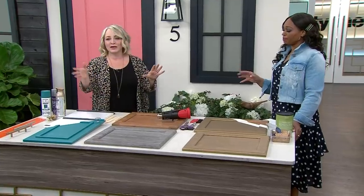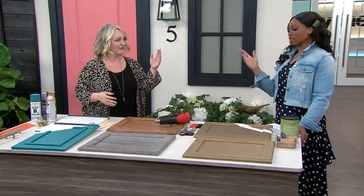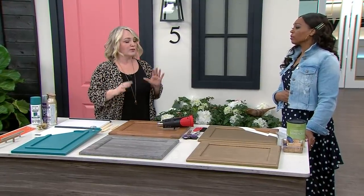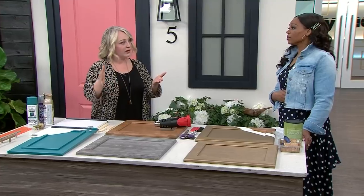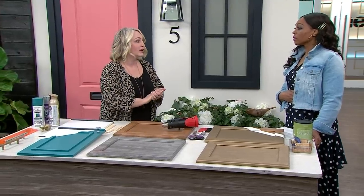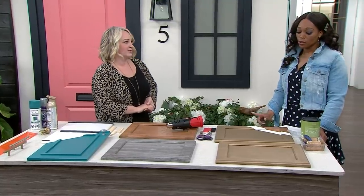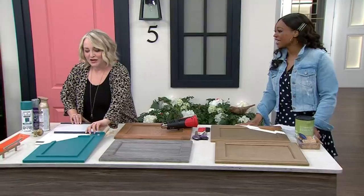It's always the prep. It's always the prep. Right? You can slap paint on anything, but if you don't prep properly, that finish isn't going to wear. Having those tiles and the bathtub prepped ensured that that surface was great, so that the paint would adhere properly, and the homeowners will get amazing longevity from it. Incredible. So you also did a lovely reno on the cabinetry. The vanity. That's really nice.